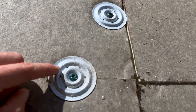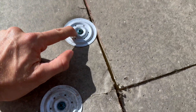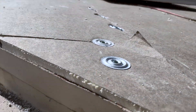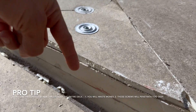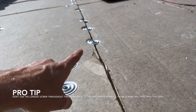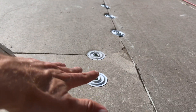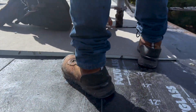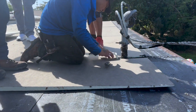You can see this is what the insulation plates look like — they have little spikes on the other side that are going to attach down into the insulation with the screws. Your length of screw is going to depend on the depth of the insulation. Back here we have multiple layers at five and a half inches, which means we're going to need screws longer than five and a half inches to catch into the wood — so we'll be using six-inch screws. As you go from the high end, you'll use longer screws, then shorter and shorter screws as you go down to the end of the tapered insulation, so you need various sizes of screws to go with these plates. The bottom insulation layer tapers all the way down to half an inch, getting us to the eave where the water is going to run off the edge of the roof. That's the design of this particular roof.